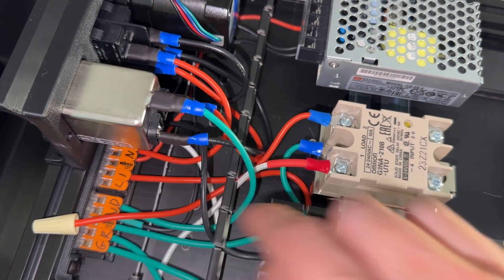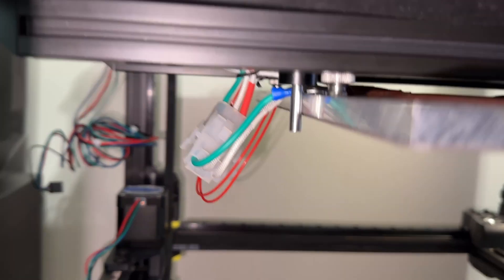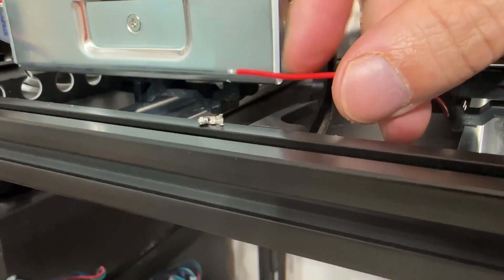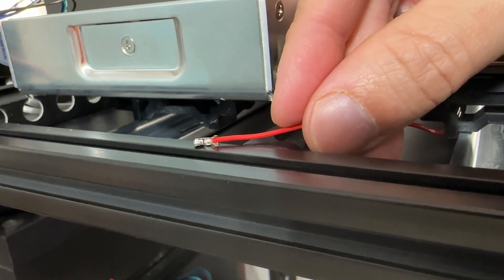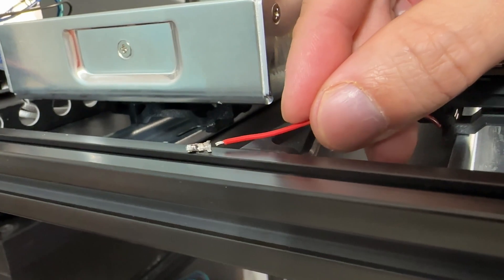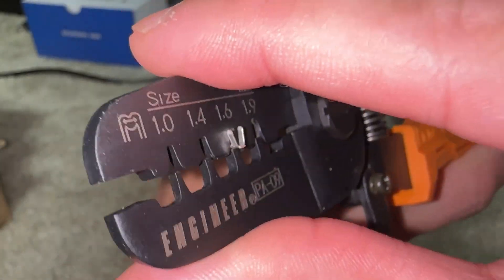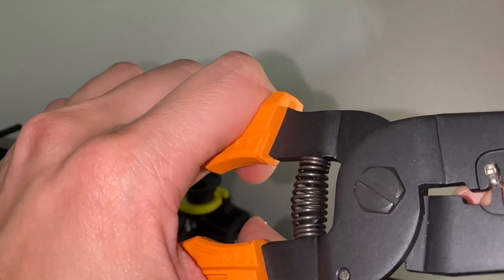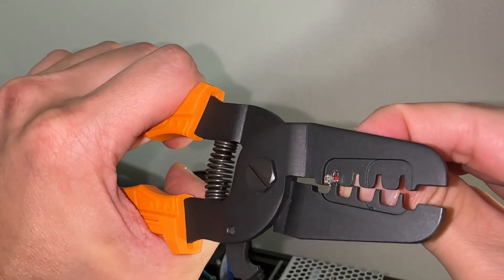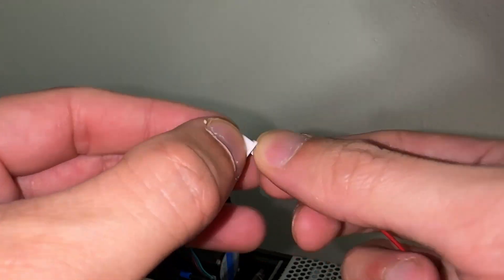Since we already grounded it, let's finish the bed wiring. I also mark the heater wires with heat shrink since one side comes out of the SSR and goes directly to the thermal fuse of the bed heater. I left plenty of slack since there's nothing in this bottom left raceway except motor wires. The two thermistor wires are crimped with a JST connector since they connect to the Octopus board. Make sure you strip the right amount of wire — the inner sleeve should only touch the exposed conductor. Using the PA09, rest the locking tab of the pin against the crimper. Insert the wire until it stops and crimp away. Same with the remaining larger sleeve — choose the crimper hole that makes the sleeve square or slightly wider. Press down and you're done. Insert the pin into the connector until the tab clicks in place.